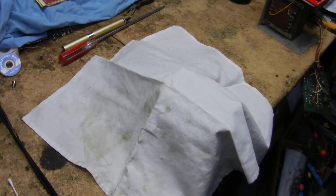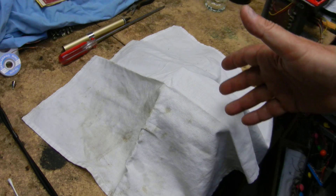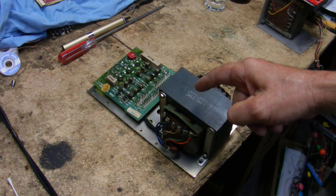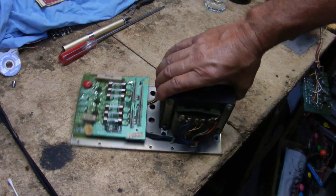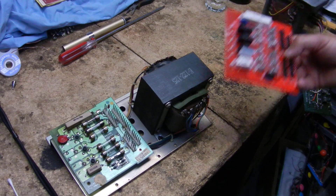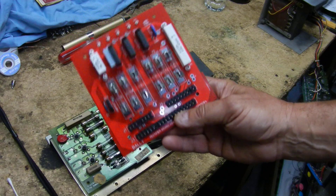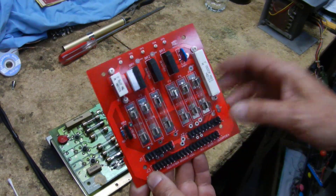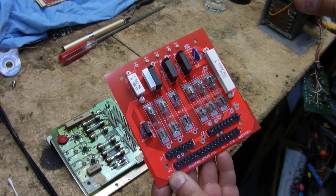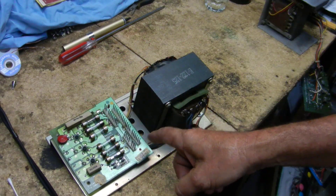What is this? A friend of mine says there's no one out there doing videos on this particular topic - can you make a video explaining how to do this job? So what's under the Italian safety hat? It's a Bally rectifier, a Bally transformer with a bridge rectifier board on it. The reason is this guy purchased a board from GeeksPCB. There's two types: one's got an eight-pin and one's got a nine-pin, and the nine-pin is for the KISS machine with an external thing - I'll do another video on that one later.